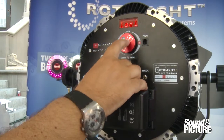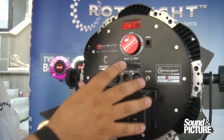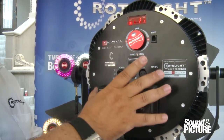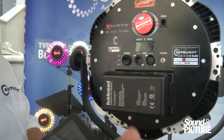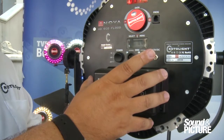You can control the lights locally with the knob, via DMX using a channel for brightness and a channel for color, or via our new Wi-Fi system. You can network up to 256 ANOVAs, and off the back of each ANOVA you can hang existing third-party lights like ARRIs and Kino Flos from the DMX out, so each light creates its own wired local DMX universe.